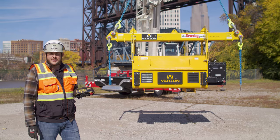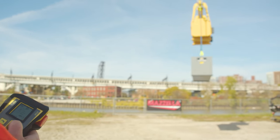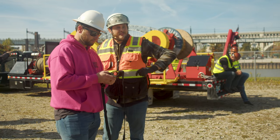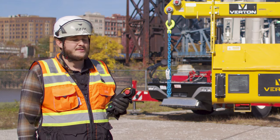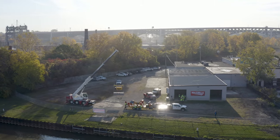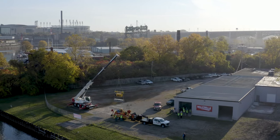With the remote control, you get about 200 meters, which is equal to about 650 feet of line-of-sight control. Whether you're 600 feet away on the ground looking up at it or right next to it, you have control with the remote. There's also a pitch-and-catch feature with the remote control system. If you're about to lose that line of sight, which is critical for operation, you have another rigger or operator at the top of a structure or somewhere in that blind pick area to be able to cast and operate independently with two remotes.